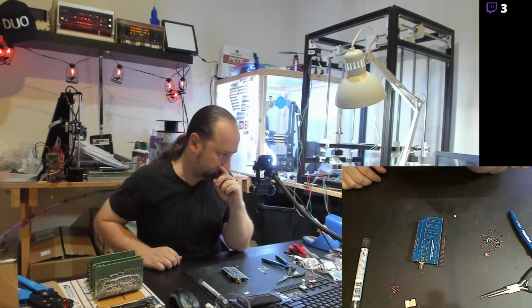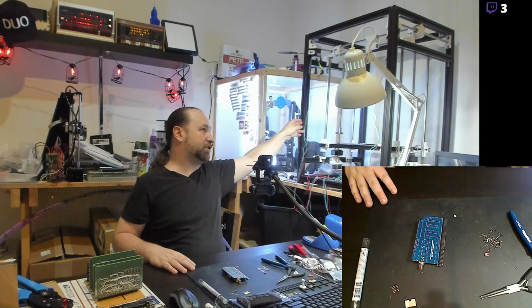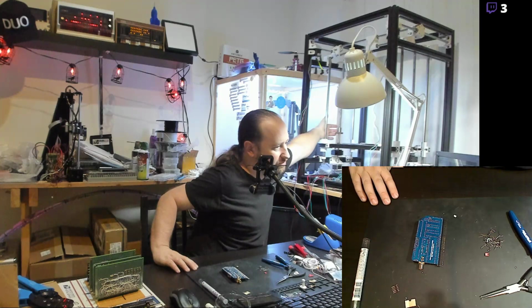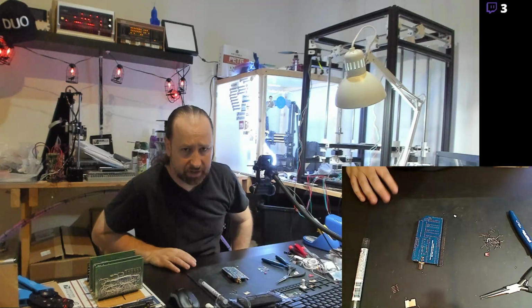I have somewhat the same thing: two rods, an extrusion, a couple of fans on it. Honestly, for 3D printing, a lot of it is the same type of parts. The Mendel Max in the corner and the Hypercube here are all using aluminum extrusion. This one has rods and ball screws. The Z-axis here, these are actually ball screws, very high precision. I got these from Ziltec in Texas. Since they're ball screws, there's no slack in them. The motion is extremely smooth, but each of those screws was $50.